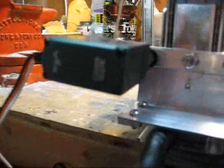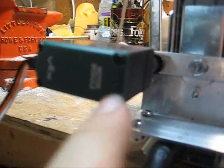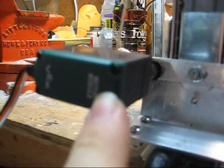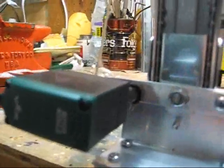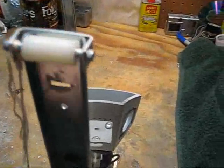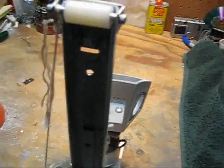What does the lifting is this little motor here. It's actually a motor from VEX, but technically it's a servo that just continually rotates. It has a little pulley on it that's attached to the top of the draw slide, and it draws up the platform as the motor turns.